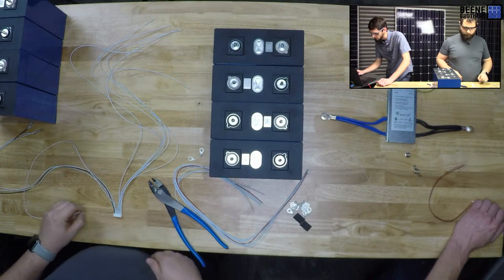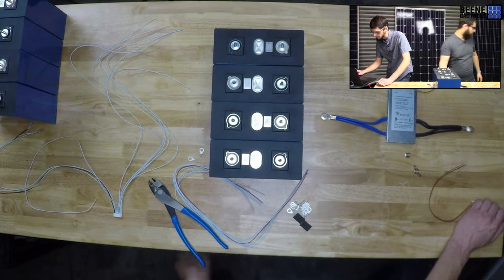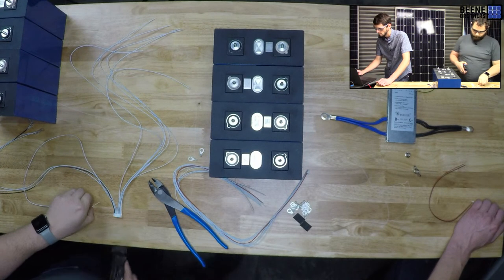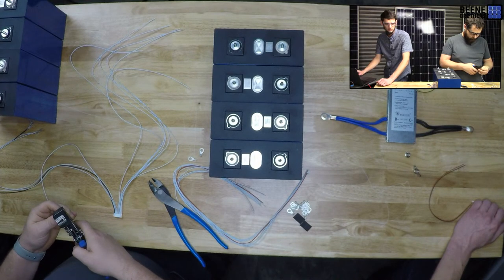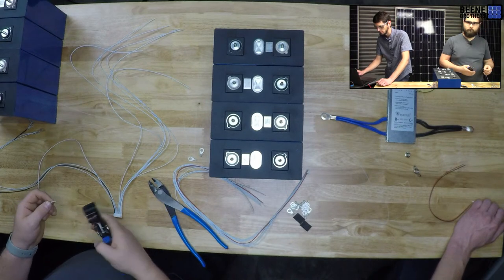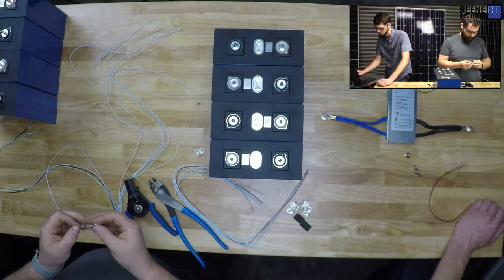Oh, Basin said they were sold out. That's funny because I just asked them the other day, and it sounded like they still had some, but he did say that they weren't planning on getting more at the moment. They hadn't heard from the manufacturer. Maybe I'm thinking that wrong. Maybe he said that he had the 280 cells instead of the 272s. Honestly, if you're looking to do 8 more, the 280 amp hour compared to the 272, I don't think it'd be a problem. Just run them all. Like, yeah, you won't get that extra 8 amp hours off of that second set if you run them in parallel or series.